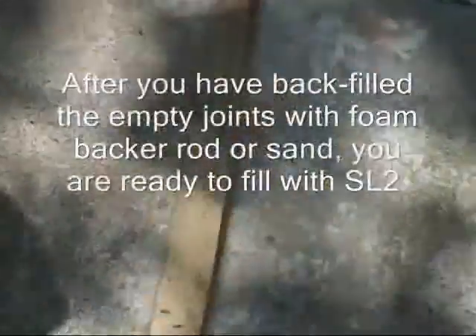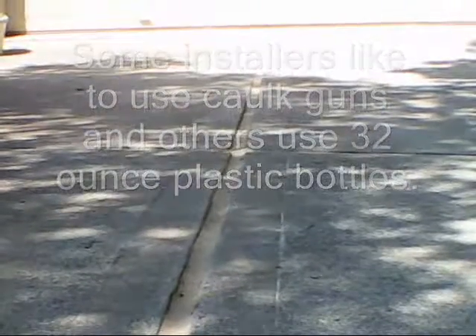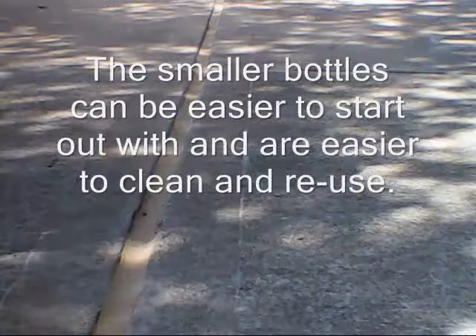Now that we've got all of our dams in place at all the corners, we have all the leaves and debris off the driveway. If you don't do that, they're gonna end up in your job. We're just gonna blow this off real quick, get rid of all the debris - it'll just take a moment, and then we'll start mixing our mastic. You want to get rid of all the leaves, sticks, dust, and everything on the driveway, because when you put glue - which is essentially what this is - in the joint, if there's any wind like there is today, it's gonna end up in the joint.